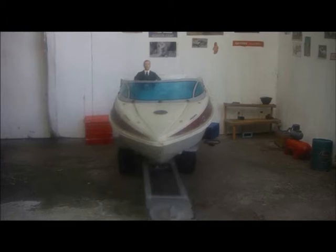I originally intended this to be a quick little video in which we changed the seating arrangements and the electronics and then spent most of the video playing with the boat. Instead, when I realised that the flex drive in the outboard had died, I was tempted just to scrub the whole video and move on to something else. Well, I'm very glad I didn't, because amazingly, a bit of strimmer cable in a motorcycle cable sheath works as a perfectly good alternative to a 35 euro Graupner flex drive.